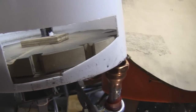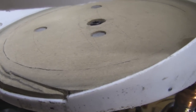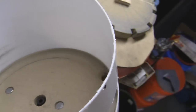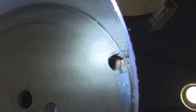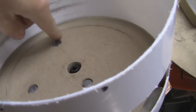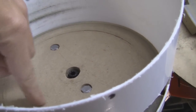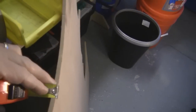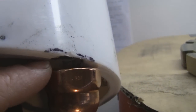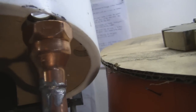The magic in this mechanism is this plate. Take the plate out — there's a groove cut here, and that's where the bullets follow through. You've got the bucket and a plate here with a hole you look down through. These bolts are countersunk into the top plate to keep it from moving; to remove the plate you take those bolts out. The plate consists of two layers of quarter-inch MDF board. You want to really round out this plate so that when bullets fall through, they're not going to get caught up in the hole.